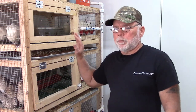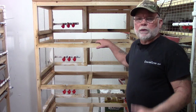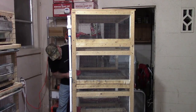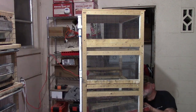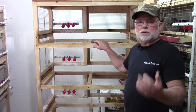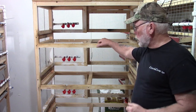I'll pull this cage out, get it torn apart, and get the floors out of it, then we'll show you how we build the egg rollout flooring and how to install it back into the cage. The easiest way to get the flooring out is once you've unscrewed it from your framework, go around to the front of the cage and tap the flooring back about three inches, then you can lift up on one side and kind of pull it out on an angle. I also took the cage system outside and pressure washed it, so when we reassemble it I've got a nice clean cage system ready to go.